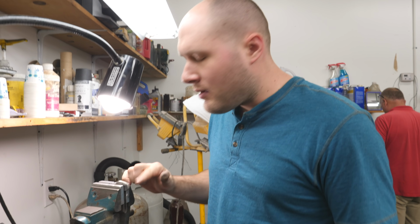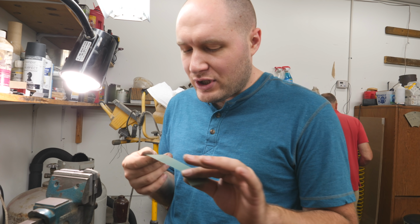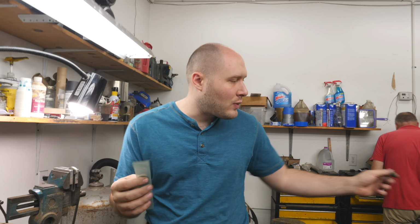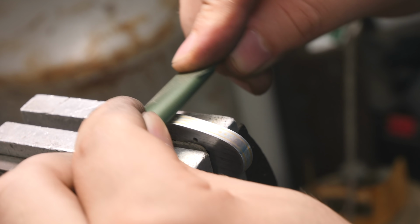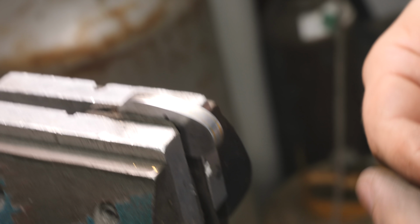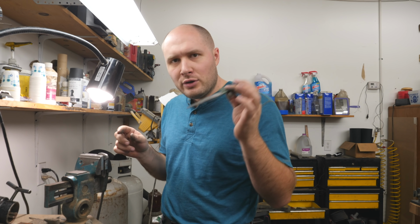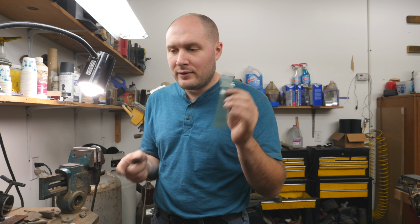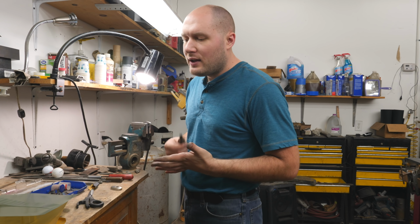I don't have any of that around yet, but this might come in really handy still, since it's diamond coated, you might be able to just keep it lubricated really well and just sand and sand and sand and pretty much not wear the diamond off, possibly. I'm gonna definitely try it out on a blade. Yeah, seems about like 600 grit. I don't think it's gonna work very well for sanding fittings though, because I don't normally like to lubricate the paper all over the fittings, like with WD-40 or Windex or anything, just because it makes a mess. I normally do that dry, but this might work really well for a blade where I'm using Windex or something to keep the paper clean, because this paper seems to just cut and cut and cut until it gets clogged up.